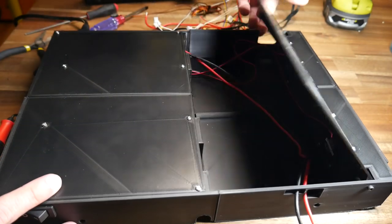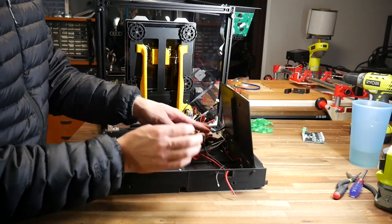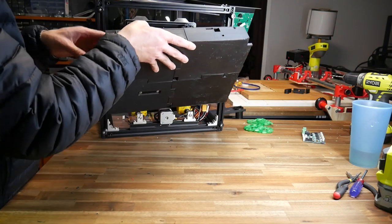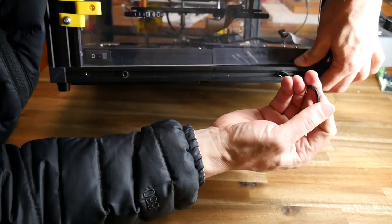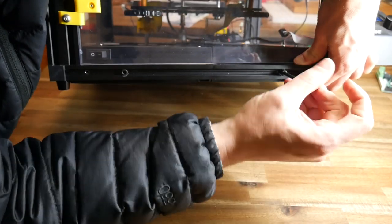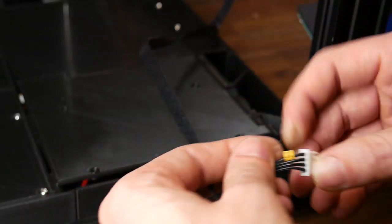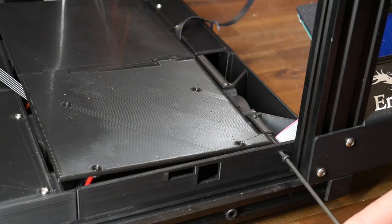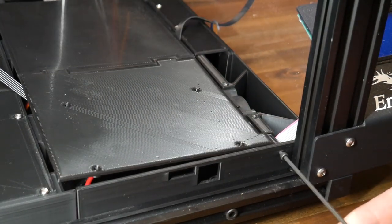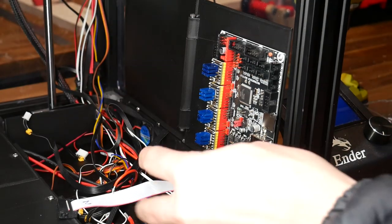Now it's time to complete our wiring by flipping up the lid and installing the mainboard. I chose to flip the printer on its back and then line up the electronics case underneath. You can then flip it up into place and insert the mounting bolts — the original bolts are retained and will cut their own thread as you insert them. There are two bolts to insert on the front as well as two on each side. You will need to undo the two bolts from the right-hand front cover, as well as one bolt for the hinging lid, to feed through the LCD ribbon cable. I'd also recommend taking the wires for the X-stepper motor and feeding them underneath the lid to make sure they reach the mainboard. Unfortunately, the ribbon cable for the factory LCD is about 10cm short, so keep this in mind if you're not installing an MKS TFT.